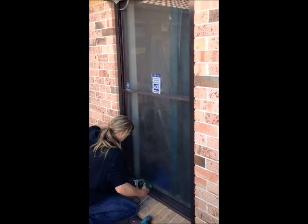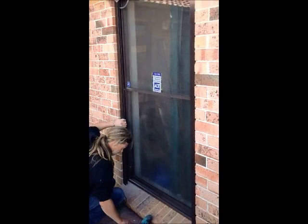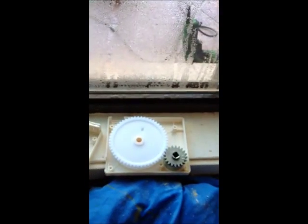Once your shutter has been fitted into position, it is now time for you to secure the tube roller that you've cut to size inside the house. Feed the tape through it by retrieving the tape using a wire loop, and now fit the winder box. This video will show you some simple techniques to ensure that if you pull the winder box completely apart, you will be able to reassemble it back into position.